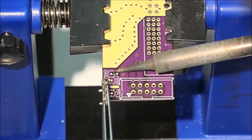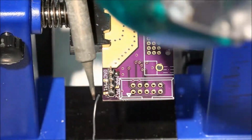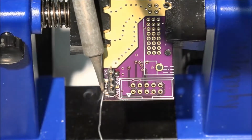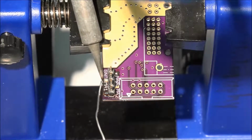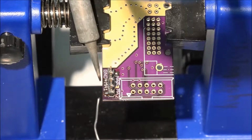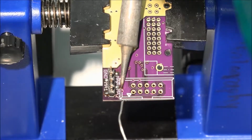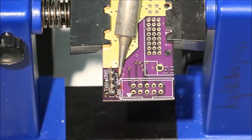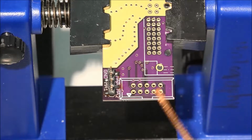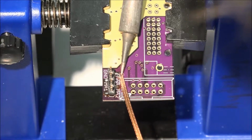We'll now begin soldering connectors, starting with the 0.1 inch pitch pin header. Like before, use an anchor point to fix it after aligning. Then solder the rest of the pins. You can see that my soldering iron is dirty. You can remove extra solder by using a flux-dipped copper braid called a solder wick.